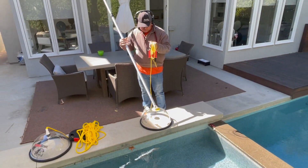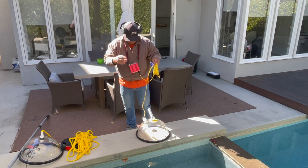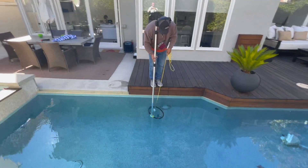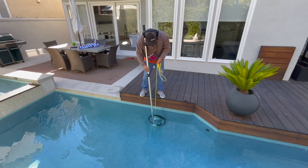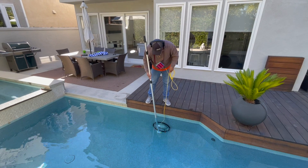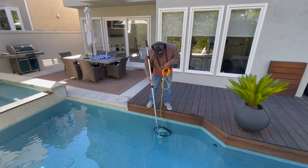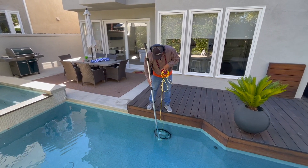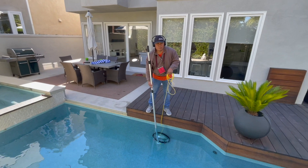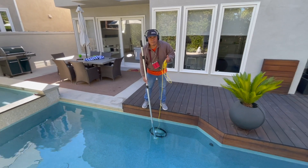Before we hold it up to the light, we hook it up to our LT-1000, which we have hanging over our neck, and we have our headphones on. So the user doesn't have to bend down or kneel — they literally hold this over the light and give it about 30 seconds to create a neutral vacuum. If it is leaking, it'll create that hard pull, and the microphone built into the chamber will pick it up. In this case, there is a leak — and here's what it sounds like. That's the actual sound of a leak going through a light into the Hydrodome.